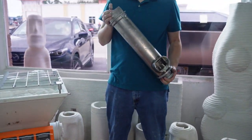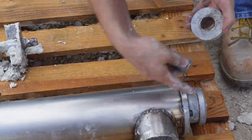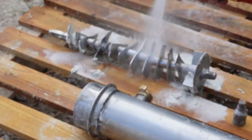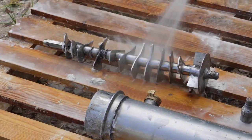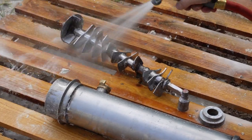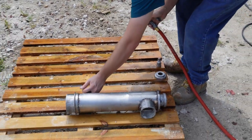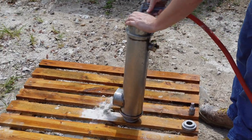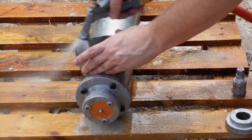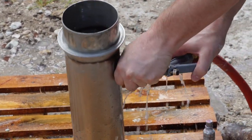On the inside of the mixing chamber, at the end where the cement comes out, there is a bearing carrier and a blade stabilizer. These parts may come loose when removing the mixing blade. Take out the mixing blade — there should be a minimal amount of material on the blades. Use a water source to clean the blades; the material should come off easily. You can also use a pressure washer if one is available. Make sure the bearing carrier and blade stabilizer are clean. They can remain inside the mixing chamber for about every four uses until they need to be thoroughly cleaned. Wash the inside of the mixing chamber until all material is removed, including small pockets of material at the end. Make sure the water inlet hole is not blocked with material.